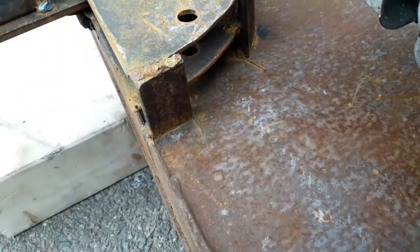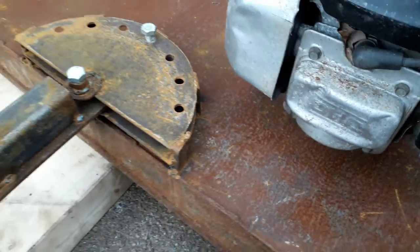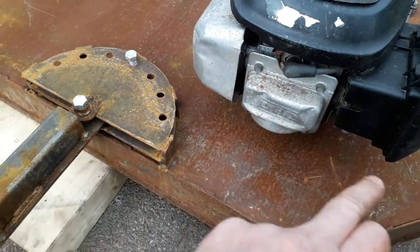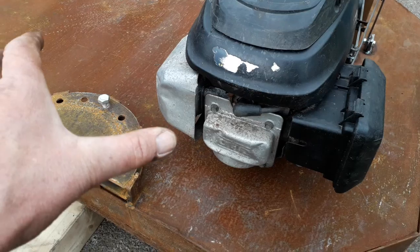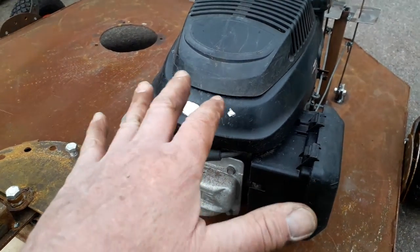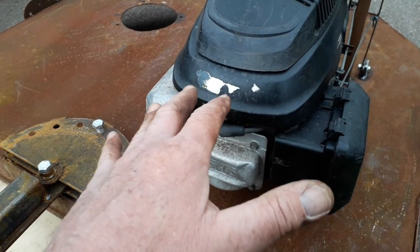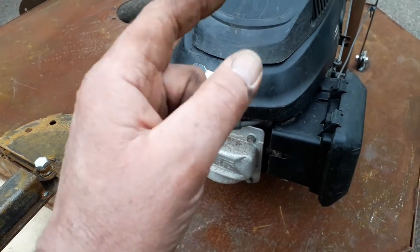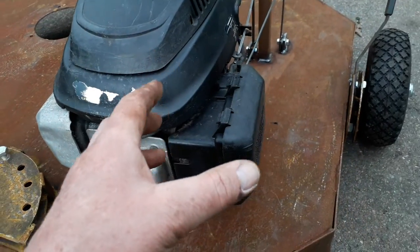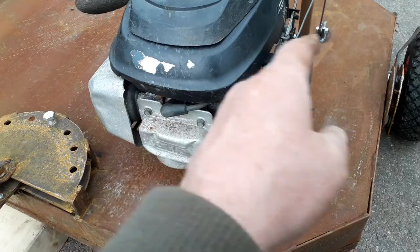I'll put a plate top and bottom for pins to align it. This is made out of 3mm - I've got to put some box section across it to stiffen that deck up. Although it's rigid, when the engine's running you get that bit of vibration going on and that'll bugger the big ends up. Once we get the other engine mocked up I shall run a couple of pieces of 25mm box across to stiffen the chassis up.